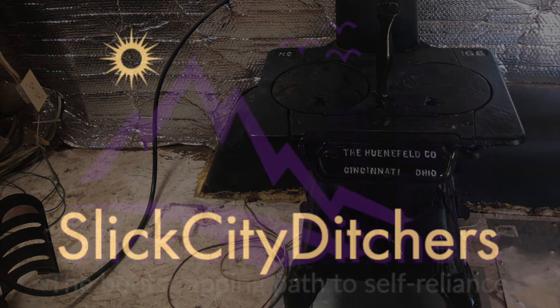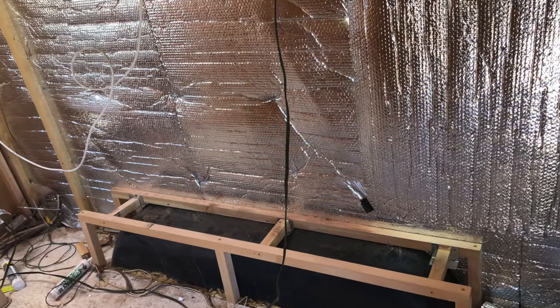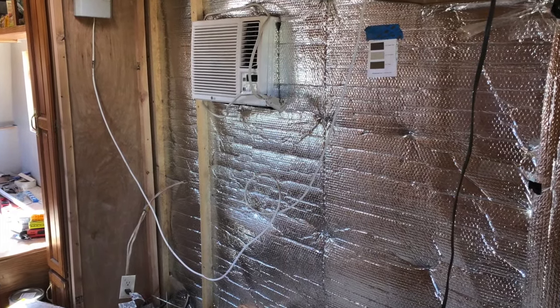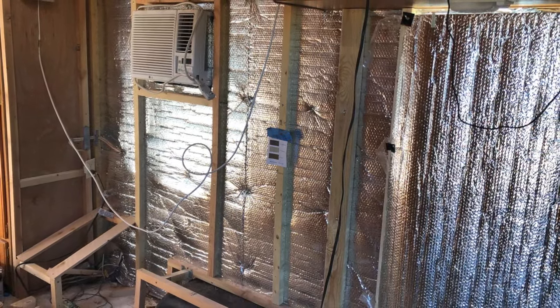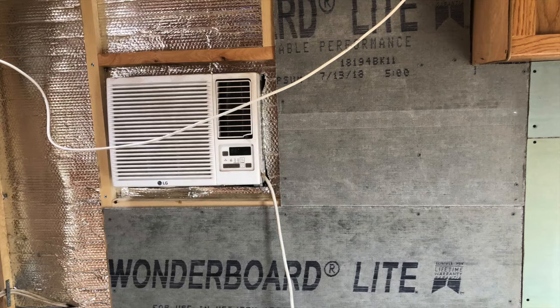This is our reclaimed brick wood stove surround project. We put up Reflectix and created the necessary air gap using 2x2s, as we have in our other trailer videos. Chad attached the Reflectix to the metal studs using half-inch self-tapping screws, and secured the 2x2s by drilling a small pilot hole then using 2-inch self-taps or lathe screws.